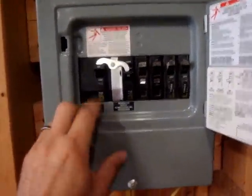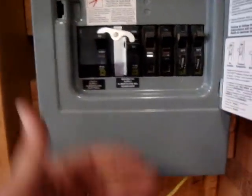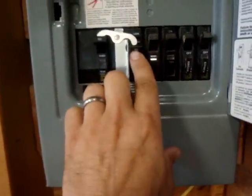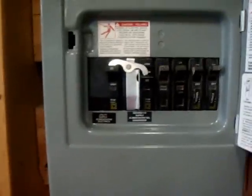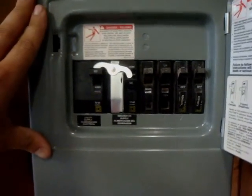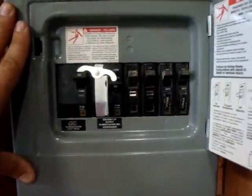The way this works is when your power goes out, all your circuits in your house go dead. You supply power through your generator to here, and when you turn this switch on it turns off your other switch, preventing you from back-feeding your panel and thus back-feeding the power lines — just like a transfer switch should work.